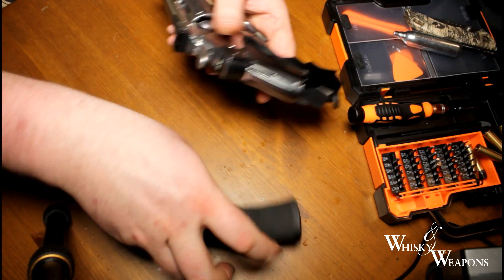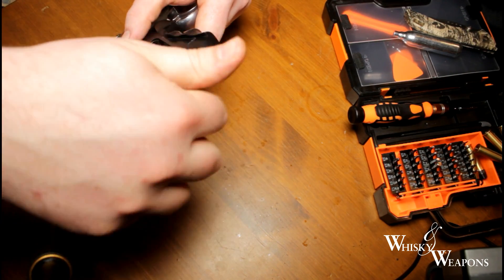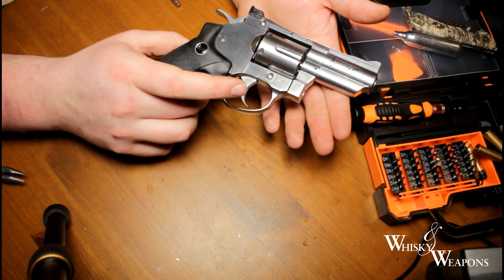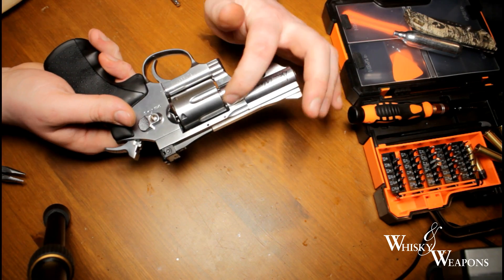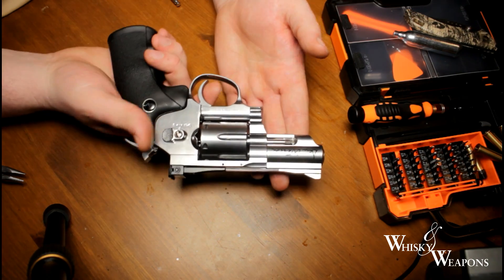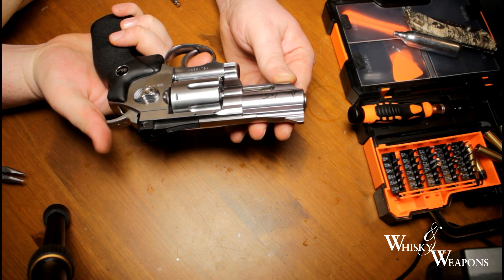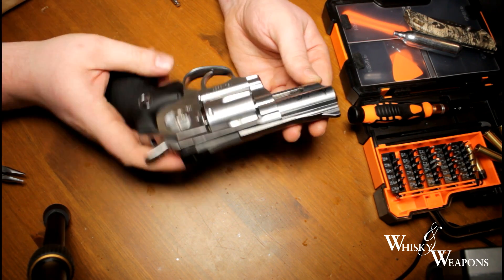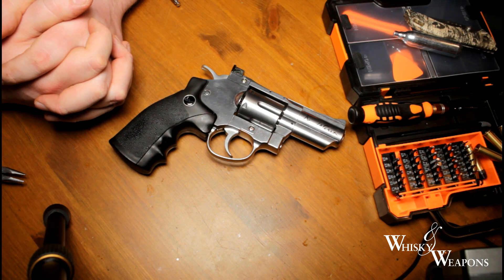So what we're doing now - flip that back on, going to pop the handle in on either side. Just go gentle with it and see if we can cock it and load it. The issue was it wasn't indexing around far enough. There's no gas in here - I don't want to hear anything from anybody about pointing a firearm at anybody, we're just testing whether the indexing is right. That appears to have cured it! A couple of parts and ten to fifteen minutes, and we've sorted that out - and not only that, we've increased the power.